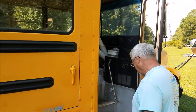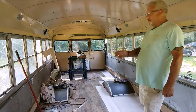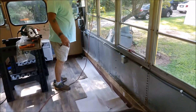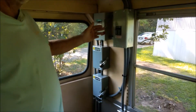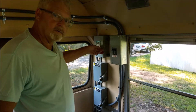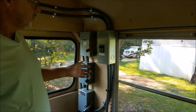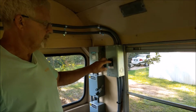There's a lot of work to be done on the electrical wiring. We had to put in industrial-type wiring so we didn't have to try to conceal it like you would with household wiring. The reason we have three switch boxes is because one is going to be for the inverter, one for the generator, and one for the onshore — the regular house current or campsite current. That way you can shut the other two off no matter which one you're using, then run all of these to the breaker box. You've got the two center for the 220 and two outer for the 110 that goes on both sides.